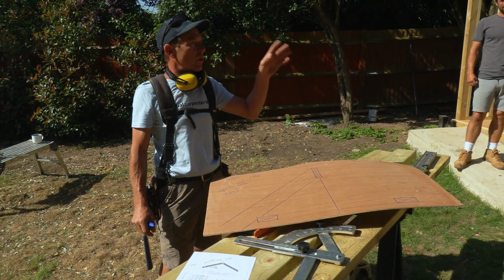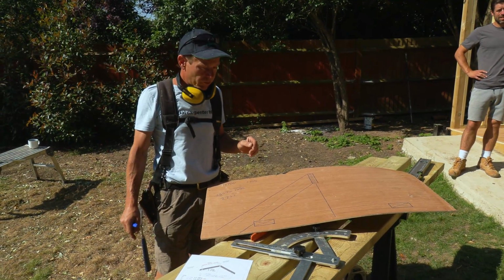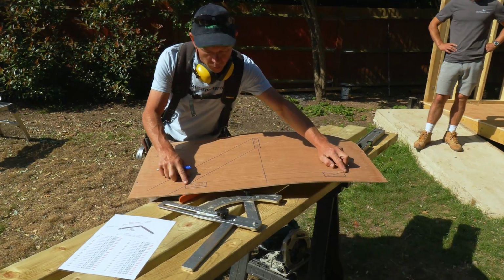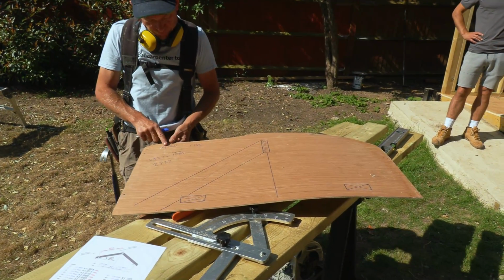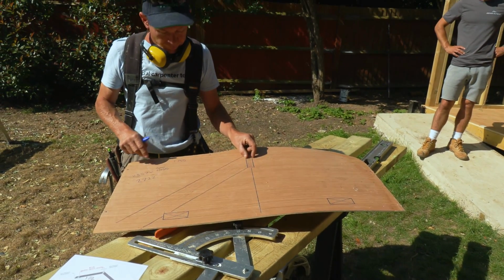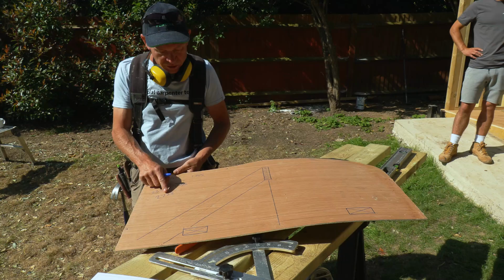Right, we're going to set up this rafter at 30 degrees. We can start off there, just to see the height of it, make sure it's not too obtrusive. So basically these are the two wall plates. So I've measured overall the wall plates, and that is 4760. Now I'm going to take the ridge off of that and divide it by 2.